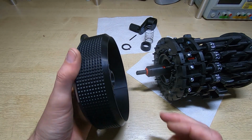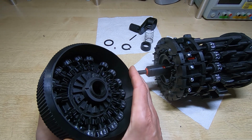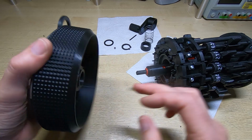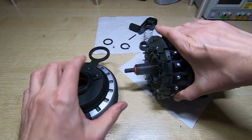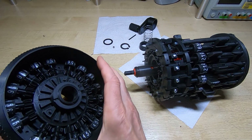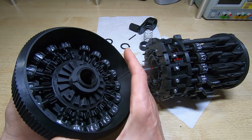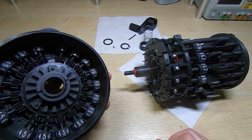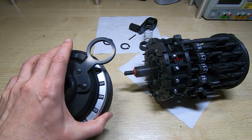if you want to try and rotate this, then that pin's going to try and come out. So it's going to try and pop down like this. But of course, when the carriage is all the way down, that pin will hit this surface, and it stops the clearing collar from rotating because it keeps the pin, the detent pin, in its stop position. So a very clever safeguard. It helps prevent rotating the clearing collar when you're not supposed to.